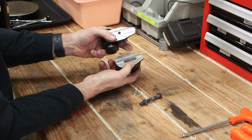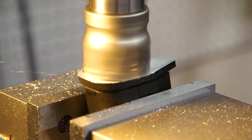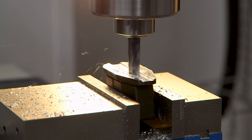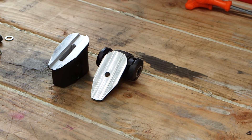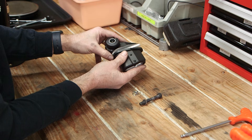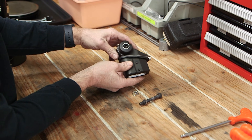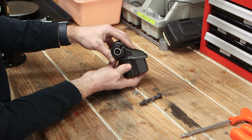I then took it over to the mill, flattened it out, and cut a slot. So now when the two halves are put back together, we've got some adjustability — some movement front to back. The slot holds alignment in every other direction.